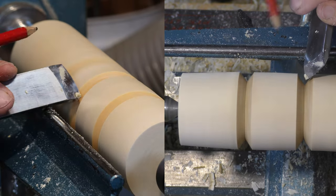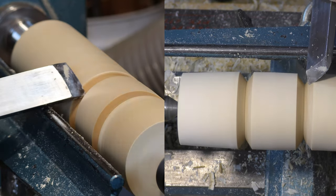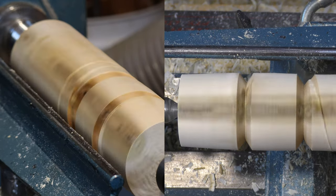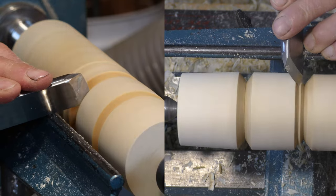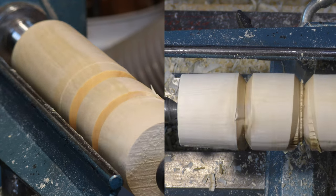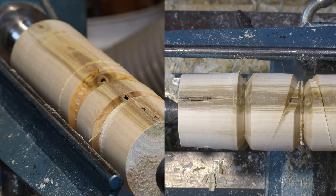If you want to have a catch, all you have to do is roll the tool back so that this shoulder here grabs the edge — and coming in there, just tilt it back and it's going to grab every time. Just in case you're not sure what's happened, that's what's happened. Doing it on the other side: I'm fine in here because the edge is clear, but just roll it over and it grabs. It's amazing how often they come up as rams horns, as pairs like that. You can see the damage that causes — it means you're going to have to change your design unless you're just practicing.